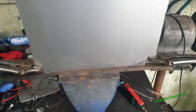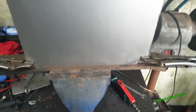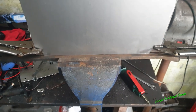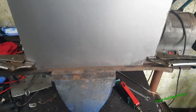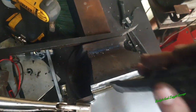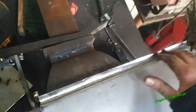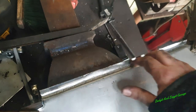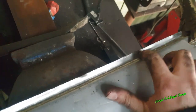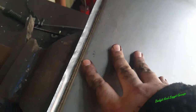Who needs a pipe bender? Just two lever bars, a box section, a piece of steel, and two vice grips. Because I wanted such a tight roll, I'm just using a hammer and a chisel, running along down here. Even a proper machine I don't think would get this 5mm bend that we need. Just straighten that up and we should be golden. Look at that - that's a really nice bend. Just a bit more work on this, but you can see by hand I've got that nice bend in there - absolutely sorted.